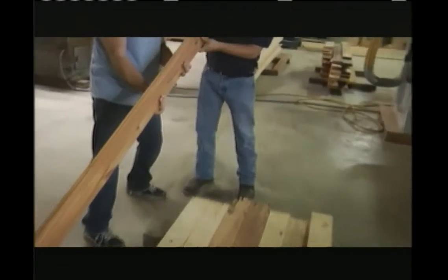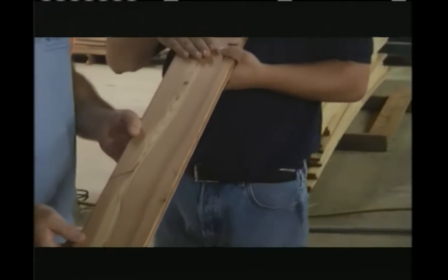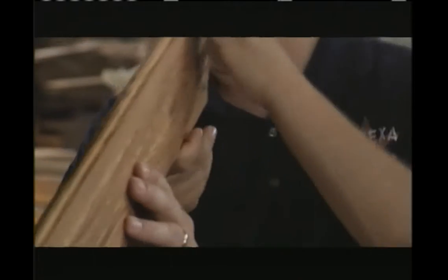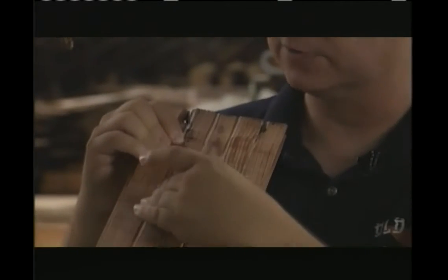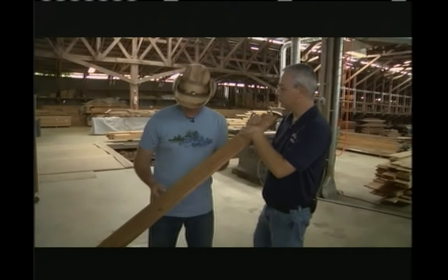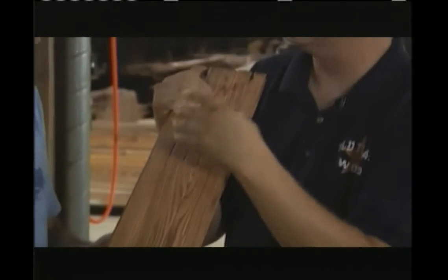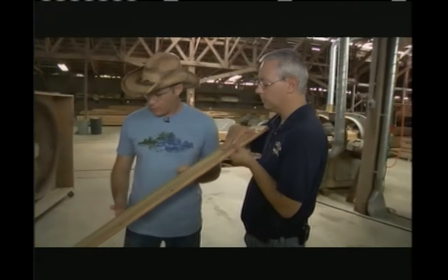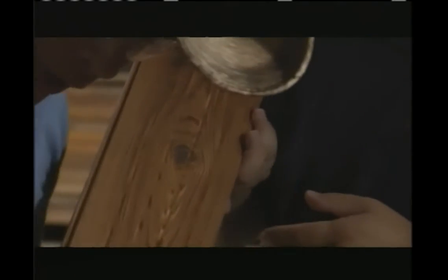Let's talk about this tongue and groove. This is the best part — now it's pretty much ready for flooring. See the little tongue over here on one side, and then flip it over — see the groove on the other side. And these are the relief grooves on the back side. What does this do? Basically if you want to glue this down, it helps pull it down and strengthen it. It's also for air movement when you nail it down. So this side goes on the ground and this is the side you'll walk on. When they stick it through the molder, they're looking for which is the most unique side to face up.